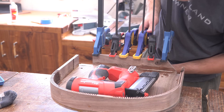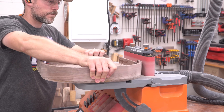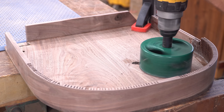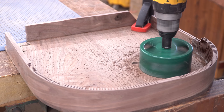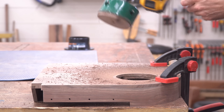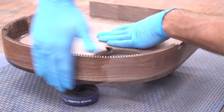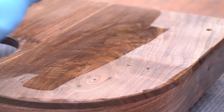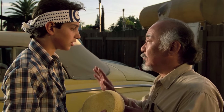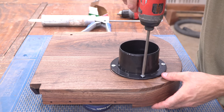Or so I thought. Dummy. With the door officially complete, I sanded the edges flush with a stationary belt sander, then switched to my SurfPrep to get everything nice and smooth and ready for finish. One last step was to drill a 4 inch hole to connect the dust collection to. If you've been counting, we're something like 20 steps in at this point, and if I had been willing to drill a hole in the original metal door, we could have just started right here. I used tung oil for a finish because it looks nice and it matches all my other shop furniture. It's also about the easiest finish there is to get right — you just wipe it on to flood the surface, then give it a count of 10 Karate Kids, then wipe it back off. Wax on, wax off. I drilled some pilot holes for the flange hardware, then put a little silicone on the back of the ring and tightened it down.